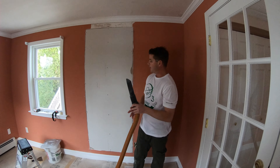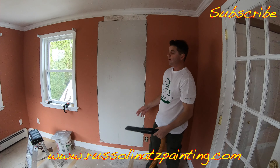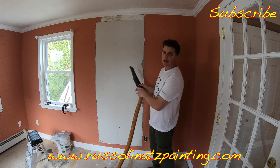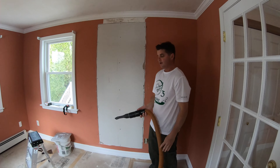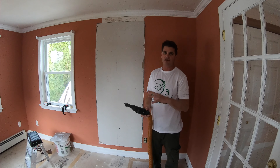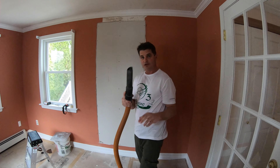We're back here and cleaned up a majority of this, but you always want to go around and use your vacuum to suck out any dust left behind from when we scraped down the sides. You definitely want to get rid of that so that when you pack it, the mud is able to stick to both sides without being able to stick to dust itself.